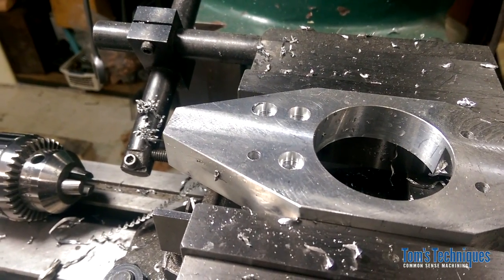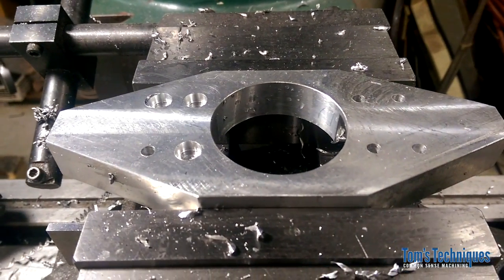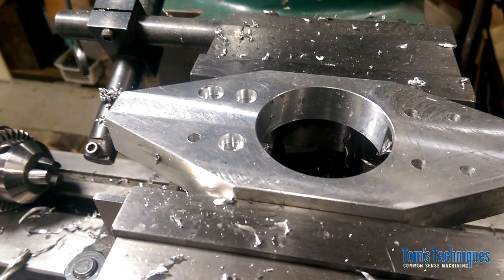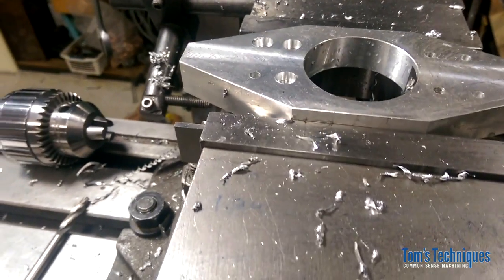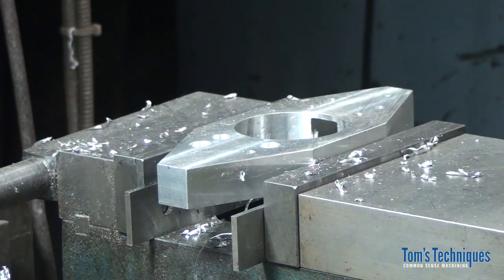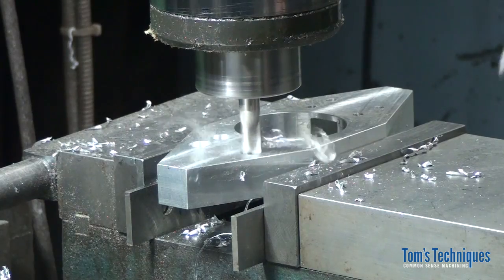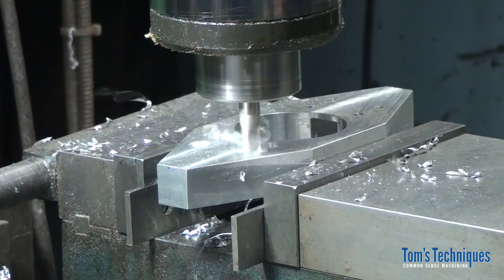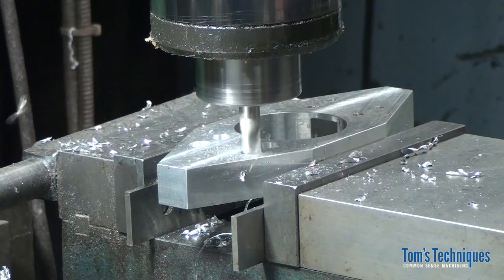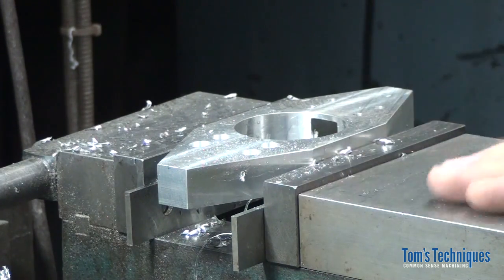Okay, just to hold the knurl holder into the slot. Okay, doesn't matter if the holes are a 1/16 different on that. It's going to do the same thing. So let's just go ahead and finish this up and move on to the next set. That takes care of those, and the next ones I'm going to do using the counterbore instead of the end mill.